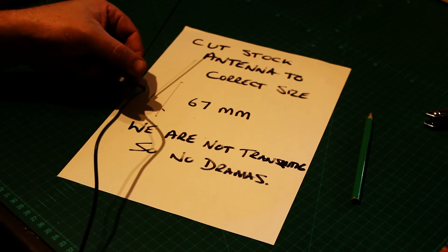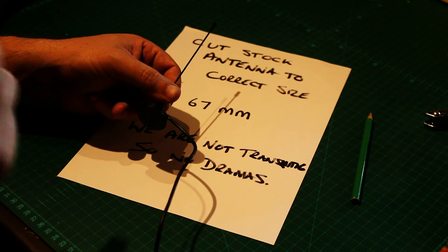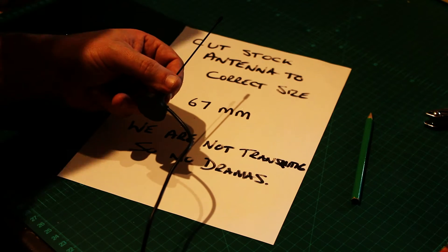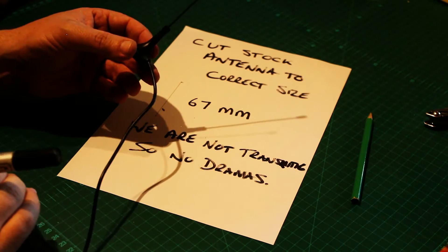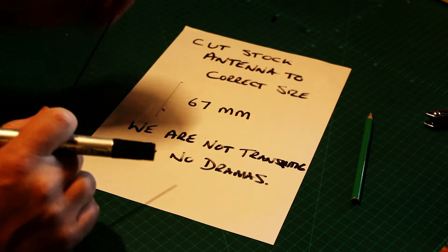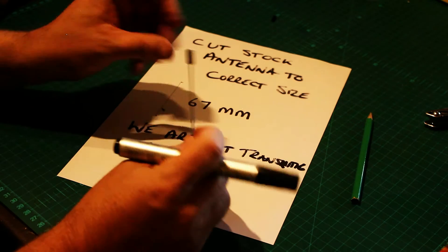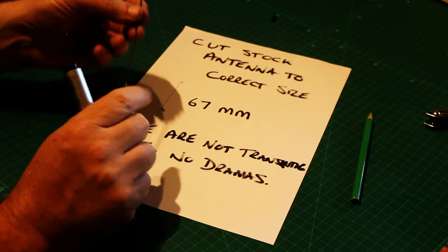The stock whip antenna that comes with it is too long. It's too long because it's designed for digital video broadcast — for TV — and digital telly operates roughly between 470 and 850 megs. So we need 1090 megs, and you've got to cut it down. A good idea is to take that little rubber cap off and then unscrew it. What we really want to do is measure from the base of the antenna — because remember that's part of it — and come up 67 millimetres.